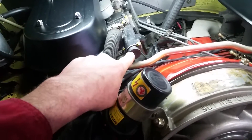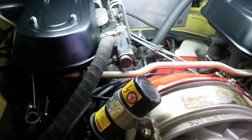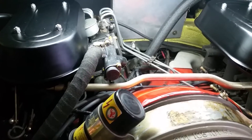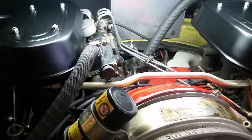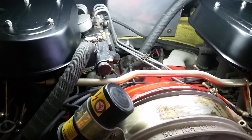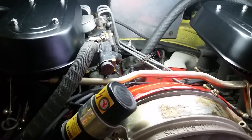Now inside under that cap there is a spring and a shim pack which puts pressure on the main rack, and that in itself is the adjustment for it, because it shifts the point at which the main rack works on the injectors and the plungers.